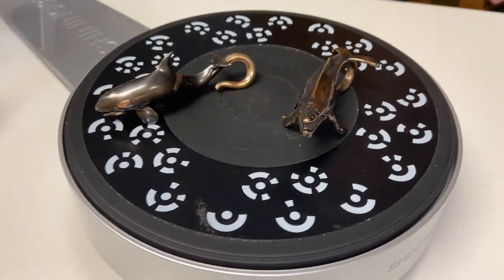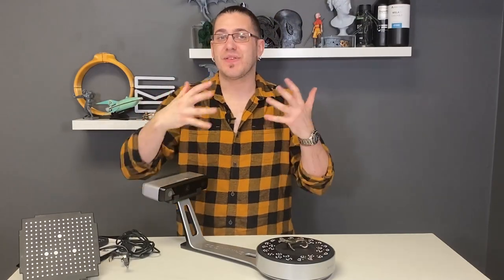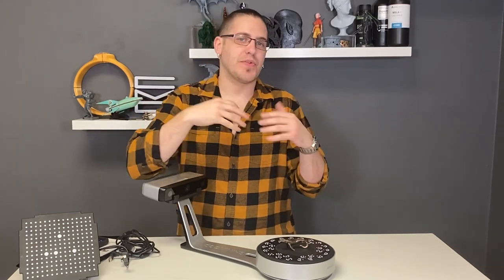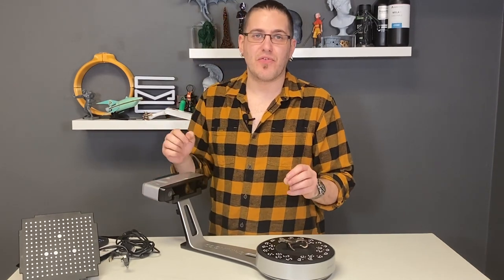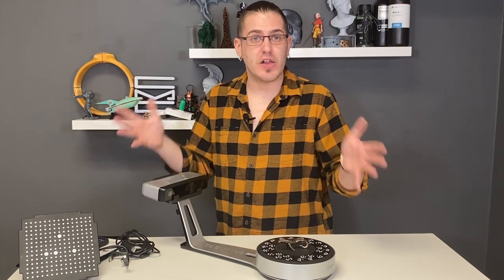I also want to do some reverse engineering, but not in a malicious way — more like getting accurate positioning of holes and dimensions of parts so I won't have to go in with calipers and a ruler and reconstruct the entire thing from scratch. I'll at least have a baseline, and given the specs of this thing, an actual model I can work with from there. This scanner is accurate to 0.05 millimeter, or 50 microns, which blows away virtually all of the competition in that more budget tier.